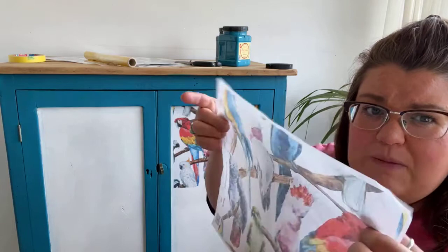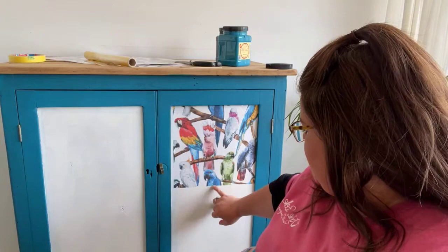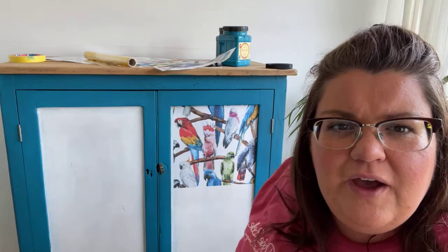To continue the pattern down, there is going to be a tiny join, but the beauty of this paper is it's so thin the join isn't going to be as obvious as with a thicker paper or wallpaper - you won't get a seam. I'm going to try and get as close a match to that seam as I can and the pattern will continue down. Once it's dry - you don't even have to wait till it's dry - you can put another coat of Gator Hide over the top for protection, which seals the paper in.